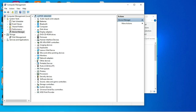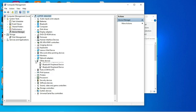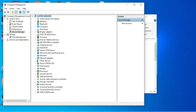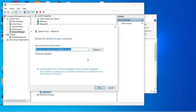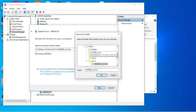Now you have to have your USB connected from your laser and your laser powered on. That's very important. Okay, so you want to check under Other Devices. It's not there on my PC, so I'm going to look under USB devices. And there you see USB LMCV2. So we're going to right click on that and hit Update Driver. We're going to browse our computer. We're going to look in our thumb drive here, our USB drive. It's going to be under the software 15 driver, and I'm using Windows 11, and it's going to be under the driver, Windows 11, X64 AMD, LMCV2 folder.